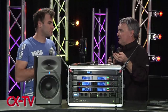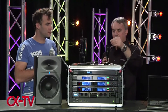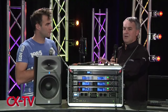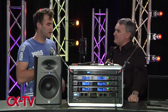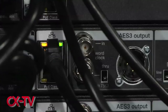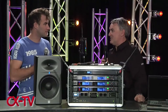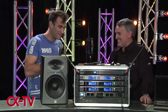If you're a large production company with many batteries rolling around in a drawer, you have no easy way of knowing which are the good batteries and which are the old ones. As you insert them into the charger it interrogates each chip and gives you a percentage readout of each battery's anticipated remaining life. Batteries at 60% become your backups and those at 90% become your main batteries, allowing you to share the wear evenly. The charger has an Ethernet port on the back — everything has an IP address — so you can interrogate your battery charger remotely.